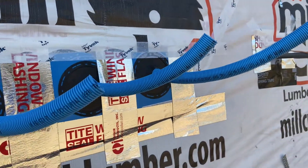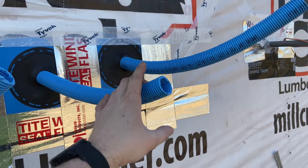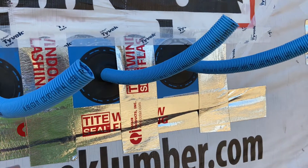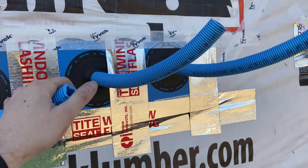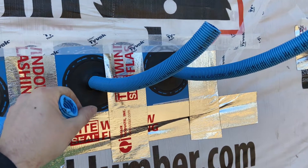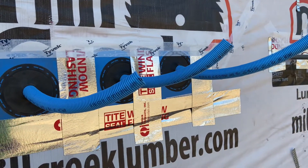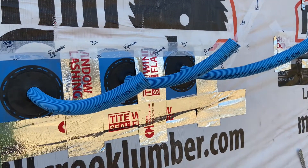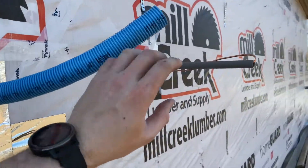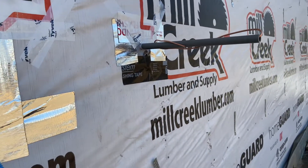These are basically internet service provider one and internet service provider two. I've got two conduits for two different lines so that as internet service changes, if I switch providers, I have the option to either have failover or gang up and combine the bandwidth — my network equipment supports that. And then the third line is the fiber demarc for the property.